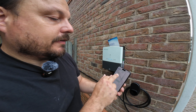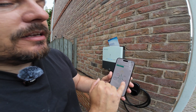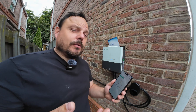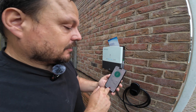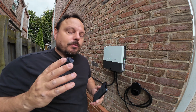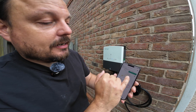On the EV charger it's currently not charging and it's waiting for that export — it says your EV will charge based upon instructions given by your GiveEnergy inverter. If you need a fast charge, hit the little button up there, or charge your EV on your own schedules. If I start it I can press the button and it'll go to grid. The interesting part — if I start to charge it, it'll start to consume, and if I go to the dashboard you can see that when it was charging from the grid, none of it is coming from the battery. The battery is serving normal house loads and the EV draw has been taken from the grid and the solar.